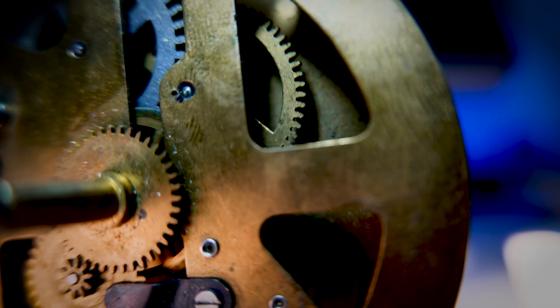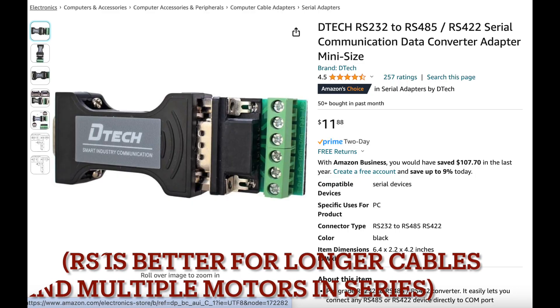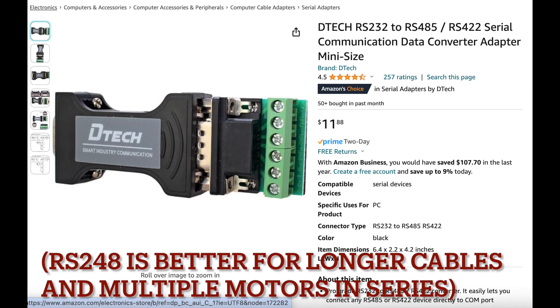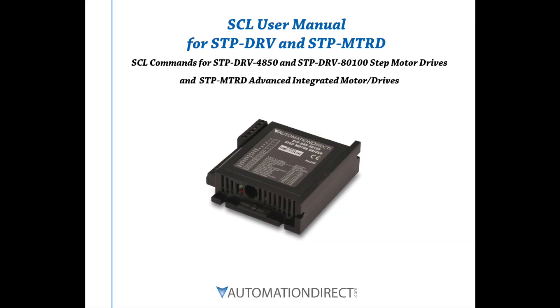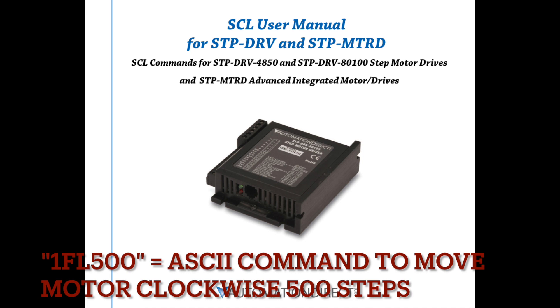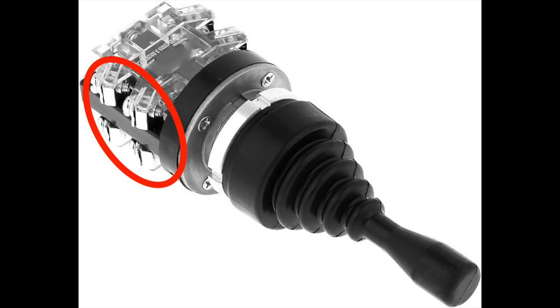Note that for outputs such as motors, you could be using port 1 or port 2 with RS-232 or RS-485 serial protocols and ASCII commands in the ladder logic to actually drive the motors to work in response to the switches or sensors, which are the inputs. But for now, we just want to attach the joystick, so we connect X1, X2, X3, and X4 separately to the four individual screw connections that are clustered together on one side of the joystick.